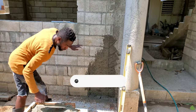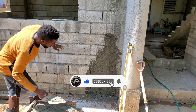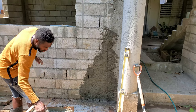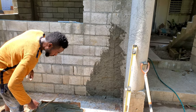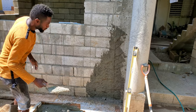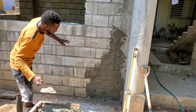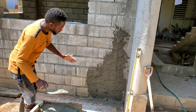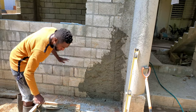What is rough casting? Rough casting is a type of exterior finishing method used in the construction of buildings. In rough casting, small pebbles and gravel or other like materials are mixed into the concrete or plaster as a finish for the exterior surface of the walls. The material dries into a rough and durable finish that is often maintenance-free for decades. Rough casting is often confused with pebbledashing, a process where pebbles and stones are thrown against a soft cement finish.